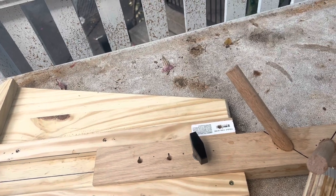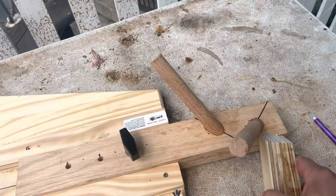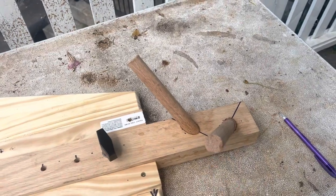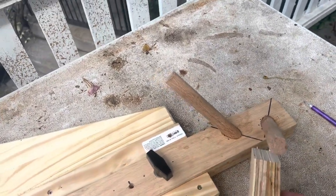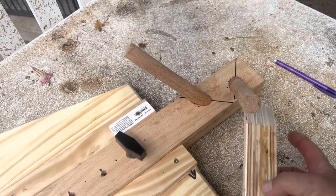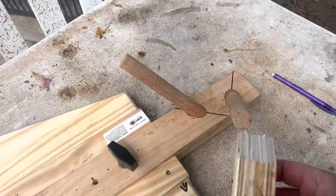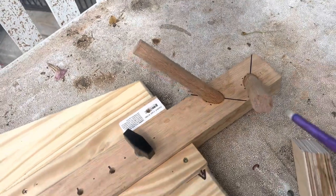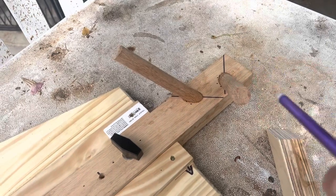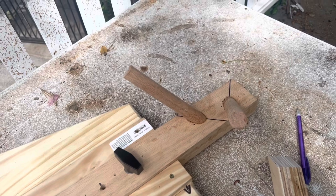So put it on a bench so it's level with this. Put something underneath here so it's level. And then sighting down it, line it up with that black line at 45 degrees there, and line up the edge of it with the little hole for the middle of the dowel. And then just freehand, imagine this is the drill bit, freehand down all the way through with your small drill bit.